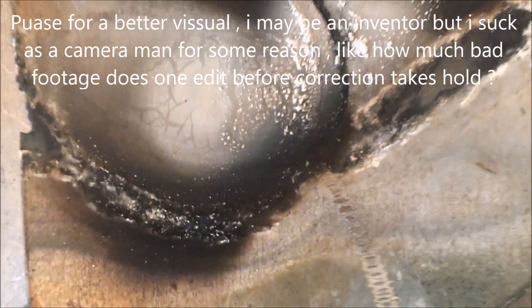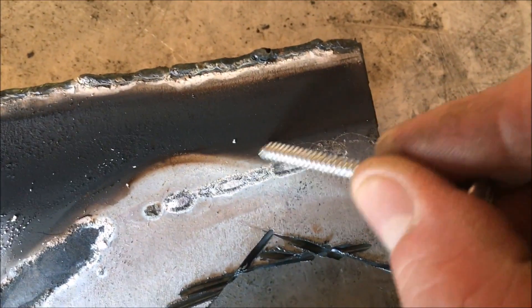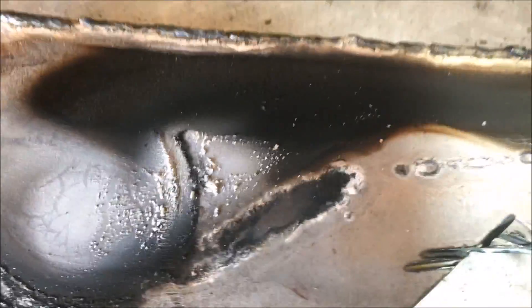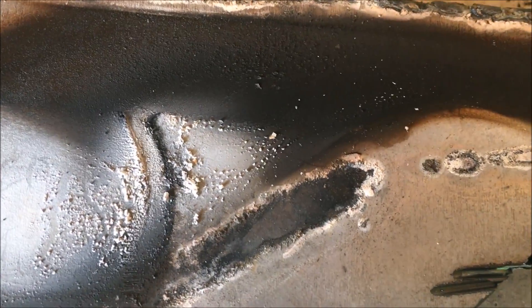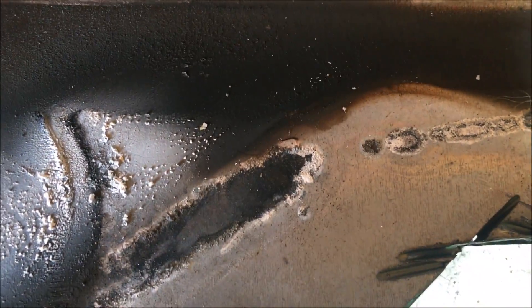You can see where the spray comes in this way and spins — look at that, baby's still hot. Look at that separation line right there; there's also a little eddy right there that would help continue the flame. This little zone right here — typically you would see a swirl right here. See where that touch-off point is, rather than the flame sticking to the panel. There's almost a straight line right there — it travels straight past the innermost area. Look at that, there's another one right here. Tell me that doesn't look like there's a swirl happening. That white color indicates oxygen-rich combustion — super heat is happening right there.